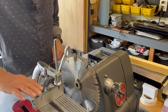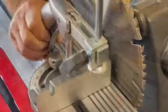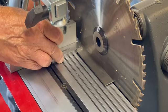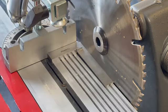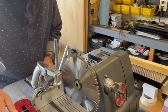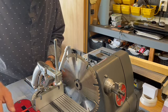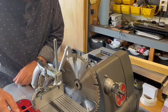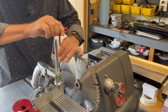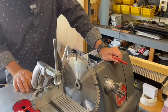Now we're going to make sure the miter gauge slots are parallel to your saw blade. That starts with first making sure the miter gauge is set up square. I'm starting with it set at zero — run my square right in there. This one looks beautiful, no gaps. That's what we're looking for right there. So, right out of your owner's manual, I'm taking a 5/32-inch Allen wrench and running it through the miter gauge — you can do that. Bring it right up until it just touches the blade. Then lock it in place; there are set screws in there, 5/32 inches. Lock it into position and make sure I'm still touching. Do that with the quill. We're ready to check.